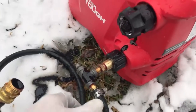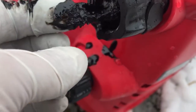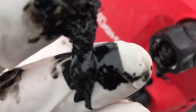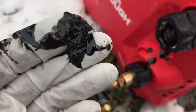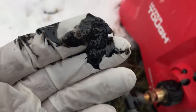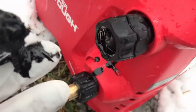This is why I say we've got to take the screens out of everything — see all that gunk in that small amount of time? It's a hairy-like substance. See those fibers? This isn't all waste oil, guys — I think it comes off the filters, I'm not sure. Now the pump can eat this stuff and so can the nozzle, but a screen just can't handle it. That stopped us dead in our tracks halfway through the test. I left that screen in there knowing this was going to happen just to show you guys so you would listen to me.